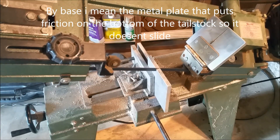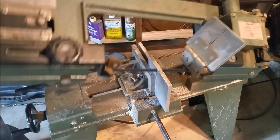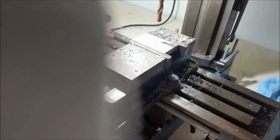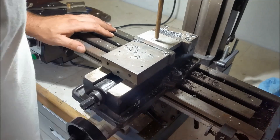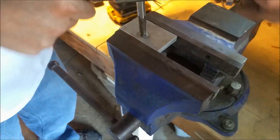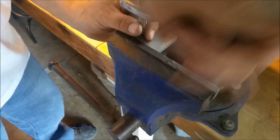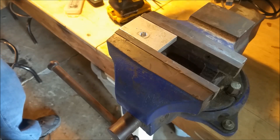Now I'm getting ready to get rid of the steel base and I'm just cutting a piece of aluminum — maybe three-eighths. I tested it, it fits, it's a little snug. If I need to thin it out I can do that later. We're going to drill a hole and then I'm going to tap this — this is a three-eighths sixteenths here. And a little trick when I cut the bolt head off — you don't want it spinning. I thought about putting another grub screw in there just to tighten it up, but I got lazy and I put super glue on there. If that gives me any problems I'll come back and put a grub screw and do it right.